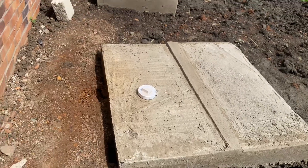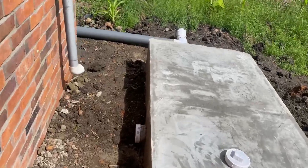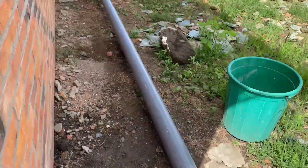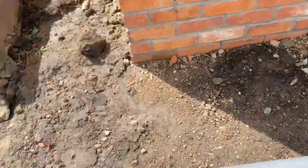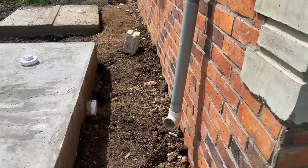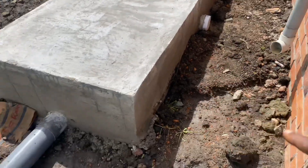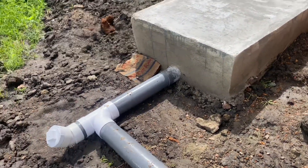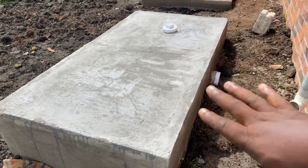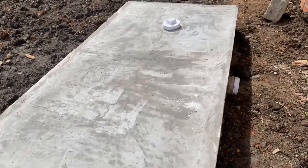This is the other digester. In this case, the homeowner had no option but to do two separate biodigesters for the house, even though it's only a four-bedroom house. This pipe has been connected straight into the digester on this side, and there's another toilet seat that will come and be picked up on the other side. In a waterlogged area, if you have many pipes, look for different parts of the digester and have the pipes enter at different points.